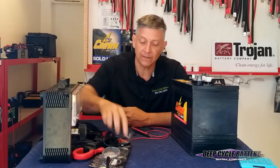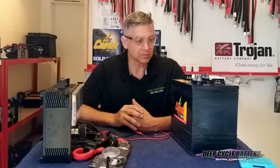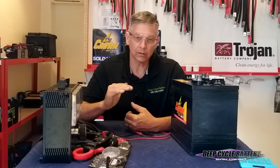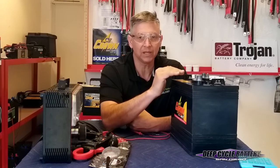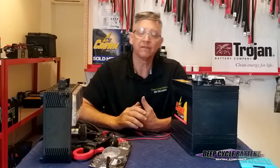So we talked about the cable. Let's talk about electrolyte. First thing you want to check — I checked my customer yesterday, I popped up the caps and checked the voltage. The customer had voltage, but we looked inside and didn't have any electrolyte. In fact, the plates were completely dry. The customer asked: can I just add water and charge the battery — will it come back? In this particular situation, because the plates were so dry, it would be a waste of time. The corrosion internally has already started. However, if the plates are moist but the water level has dipped below, there's a good chance you can just add some distilled water back to the top of the plate — not fill up the cell completely, just to the top of the plate. Cap the cell, recharge the battery, and you might find that the battery comes back.